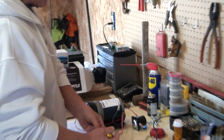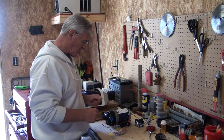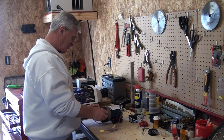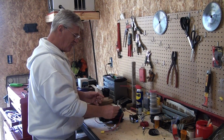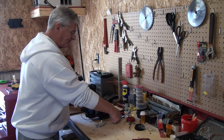And it's that simple. If you connect this the way I just showed you, this will work every time. So that's what it's going to look like. This is already going to be hooked up. You just have to cut this one away from the relay switch. You'll cut your ground away from the relay switch. You'll just route your ground over to your solenoid.